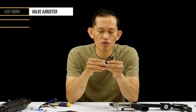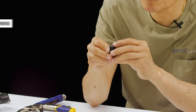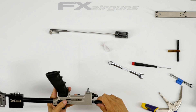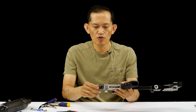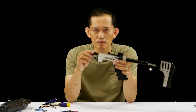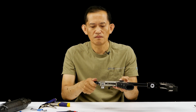When you inspect the bumper, make sure the rubber ball is in good shape. If there's an indentation where the hammer keeps hitting, you can take it out and flip it over to get a nice fresh surface. The default setting when testing is line number four. Adjust this last — after getting your velocity, tighten it down until velocity starts to drop. That gives you full velocity control via the valve adjuster. If it's fully open you're wasting air, it gets louder, and it's not efficient or consistent.